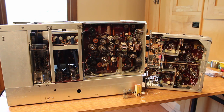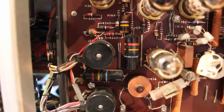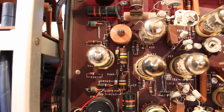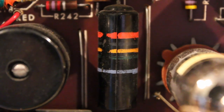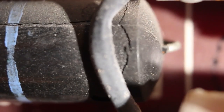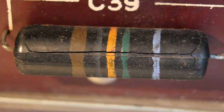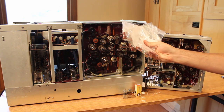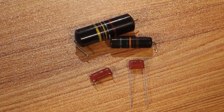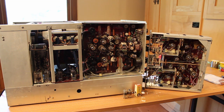In the previous episode there were fantastic comments suggesting I should take a look at the black beauty capacitors on the primary system. I initially didn't realize these were a specific type of capacitor because they look kind of like large resistors — black capacitors with color codes on them. On first inspection they looked okay, but closer up I could see the black plastic casing was split on most of them, which is probably a pretty good indication that these are no longer good.